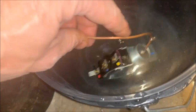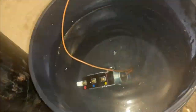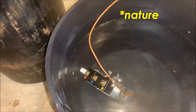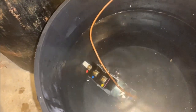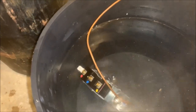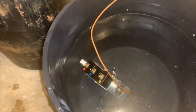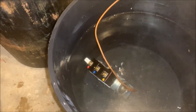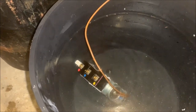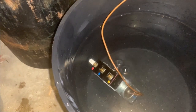The bubbles tell the tale. A lot of more experienced techs might know this as second nature, but I thought it'd be something nice to share. That's why the oil was coming out. Sometimes you have leaks that just seem to disappear when you've got the unit off. Think about what the unit is doing — is it a high pressure or low pressure switch? It's a low pressure switch, so during operation it's running low pressure and obviously has its highest pressure when it's off and everything's equalized. You've got to think outside the box — what the switches and safeties are doing — and think about what state it's in during normal operation. And that's kind of where I led to this conclusion, that it had to be leaking due to that.